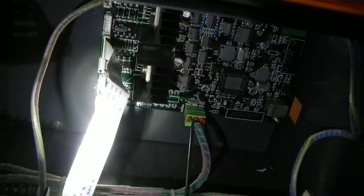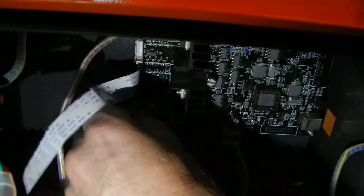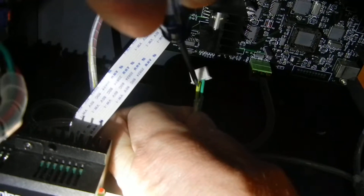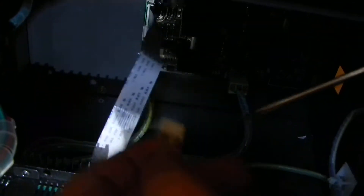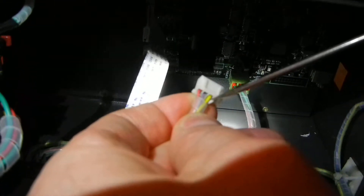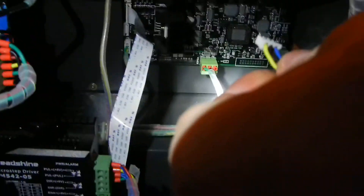Let's go to the USB board in the back. From this side that's a green, middle is black, and over at the other end is red. Unplugging the first connector — top is green and bottom is yellow with green stripe. That plugs in at the bottom, the one all the way to the top on the side. The next connector goes red, blue, yellow, white — plugged in with red on top and white on the bottom, at the top side of the board. The top middle connector is yellow, black, blue, plugged in at the top middle.